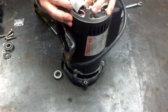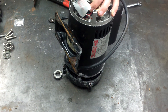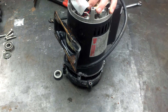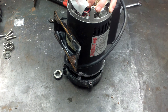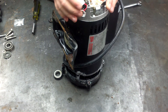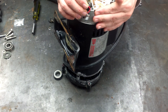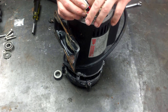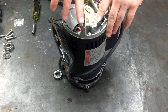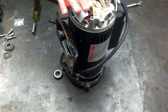Make sure your capacitor is seated on that little shelf, which it is. Then take your screw and tighten it down. Don't go crazy — you don't have to tighten it super tight, but you want to tighten it pretty good. You can see the capacitor does not move. The guard is there, so when we put the cover on, this is going to fold over the wires. We can see our stationary switches there and there are no wires protruding. When we spin, you want to make sure there's no wires in the way — nothing is going to get caught up when we start up this motor. The capacitor is on.